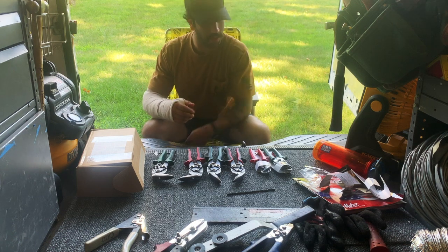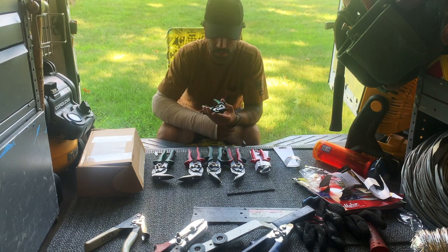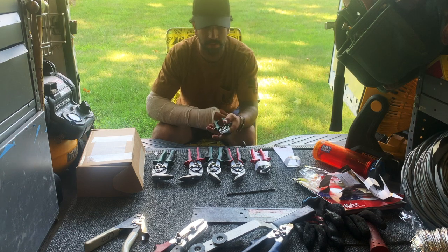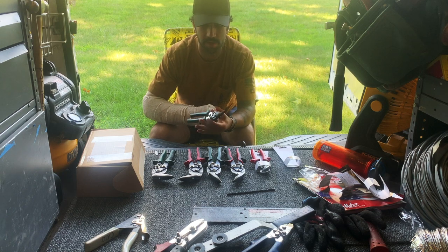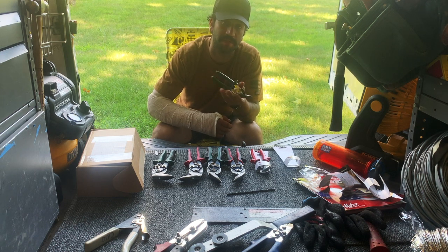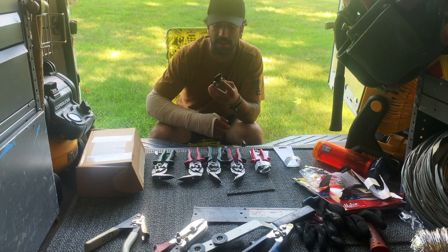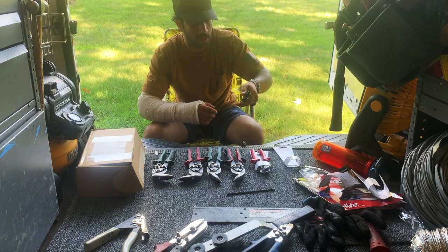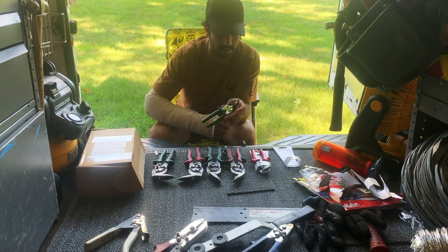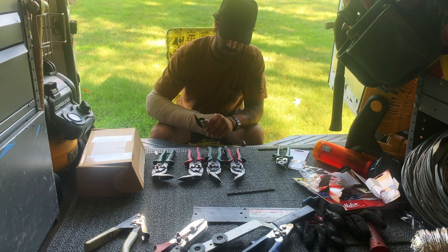And then these, got ants crawling up my leg. These are the minis. They're not the AV style. Well, they're AV minis, but they don't have the PowerFit grip like these models do. But these right here are excellent if you're cutting holes for dampers, for shafts. If you're putting in a damper that has a motor attached to it, or anything that has a little shaft where you need to cut a small hole, like a 1-inch or 3/4-inch hole, this will make that hole nice and tight and smooth, and it won't have a bunch of teeth sticking out. I'll show that in a later video, but these are the AV minis, very comfortable in the hand, very small, and these are great.